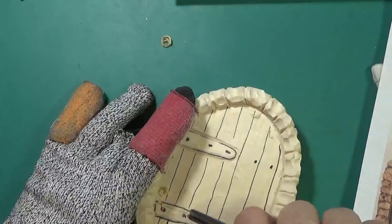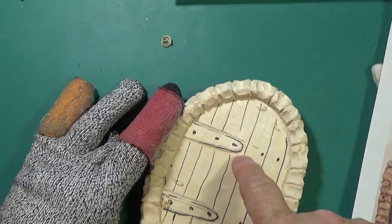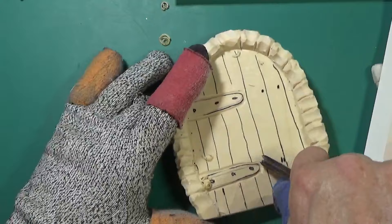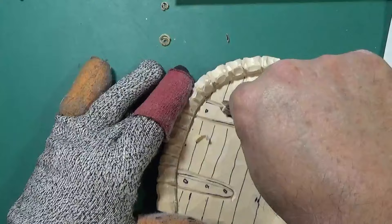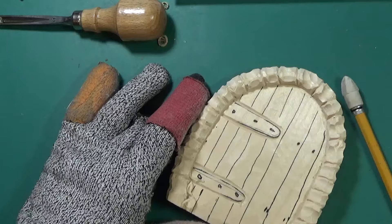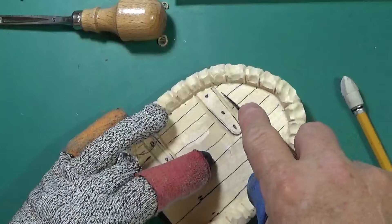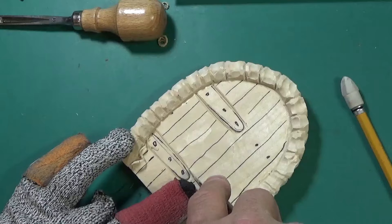Know that the wood underneath is going to be very forgiving - you get to do whatever you want. Do you want doors that look highly lacquered, or rough and belonging in the forest? That's your choice. Now I'm going to take a flat gouge and deepen these just a little bit more. Let me first take a sharp knife and score those lines. This is a Pinewood Forge knife - Dale Stubbs makes those and they're really good: short, stiff, heavy blade. I know Helvey makes one similar, OCC and KCT makes one similar - use whichever knife you feel more comfortable with.